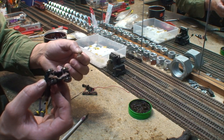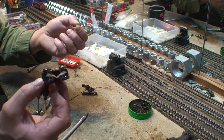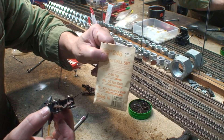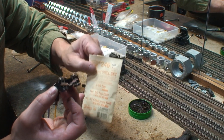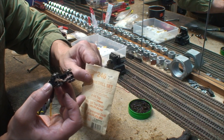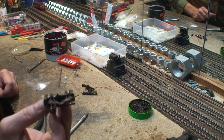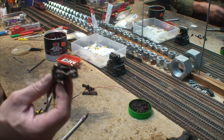The question is, I don't know exactly what drill bit I used - I physically matched it up. It is not as big as a number 43. In your number 46 tapping set, the big one's too big, the tap is slightly too small, so you need one just a little bit bigger. I dug it out of a box here, but I had one. Sweet - that's really nice.